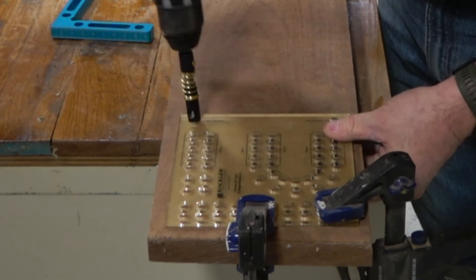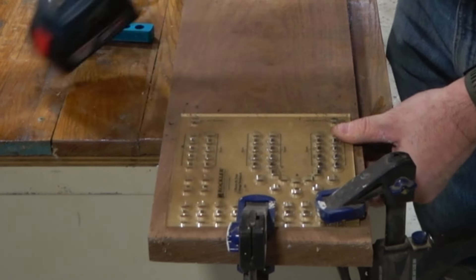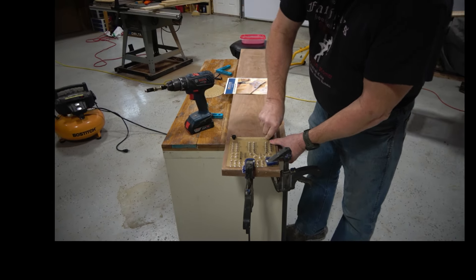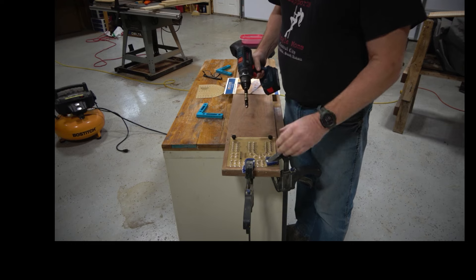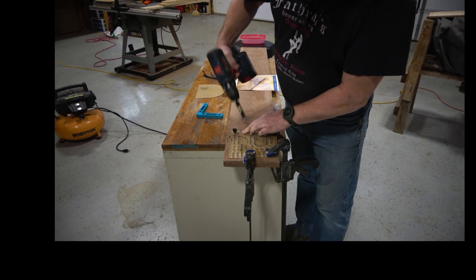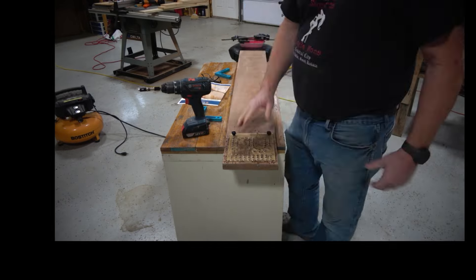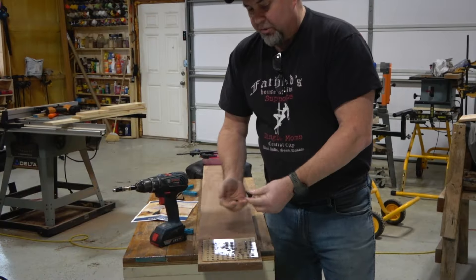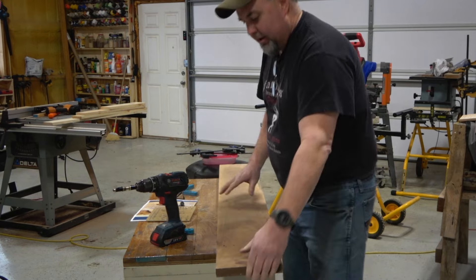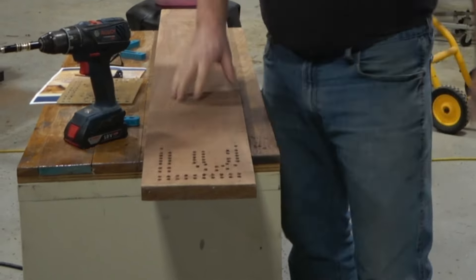We have these nice little seats right in there. It works really slick — we put in these locking pins and they hold that jig in place. I could remove it, but since everything is seated in it's not going to hurt anything leaving it there, so I'm going to go ahead and keep on drilling. There's a good example of how it can get all plugged up — you've got to clean that out, otherwise you won't get a good seat. We've completed our first jig section, we'll take these locking pins out.